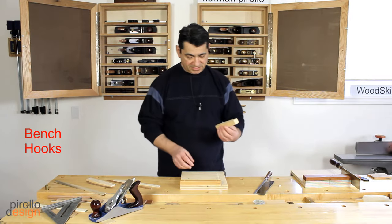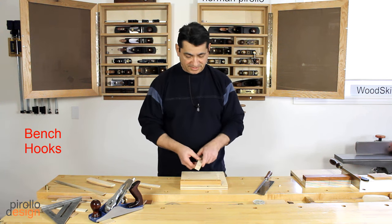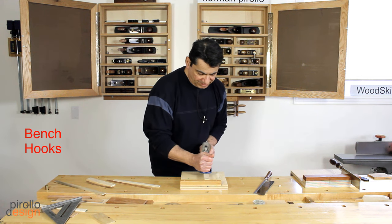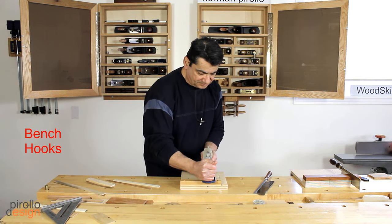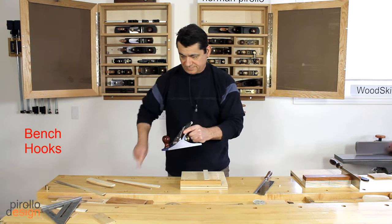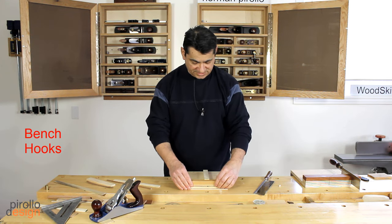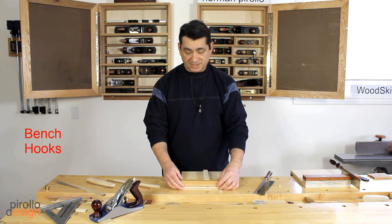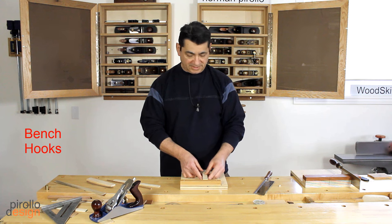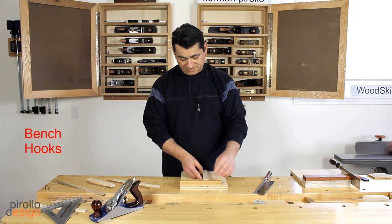Demonstration: if you have a small piece of wood you need to trim and you don't feel like setting up a tail vise or a component, you can use it as a small plane stop. The only caveat is the fence height is variable — I've selected about an inch tall — so the board you're planing would have to be taller than one inch, with an allowance to keep it from slicing into the fence.